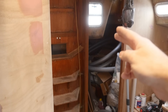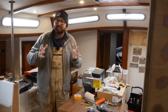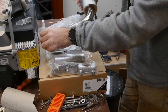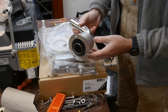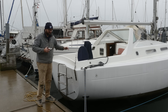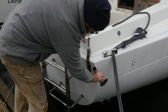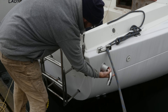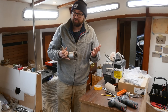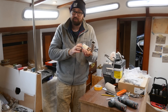The second small fan heater is going to go here in the aft cabin — it's a little bit cramped in there right now, and before I can add the fan heater I need to sort out the lithium battery situation. And then there is the second large fan heater going in the forward cabin — that one is stuck in customs but hopefully I'll get it next week. I've still got one of the big puzzle pieces left: the exhaust. The heater is installed on the starboard side of the hull and there are some recommendations — I need to stay under 10 feet in length, stay 36 inches above the water, and not have more than five 90-degree bends. That translates into being able to install the exhaust somewhere right around here, which is not great because of the dock line, or maybe somewhere on the transom, which isn't super awesome either because that's where we go on and off the boat. If you have a suggestion as to where I should place the exhaust through-hull, please leave a comment down below.